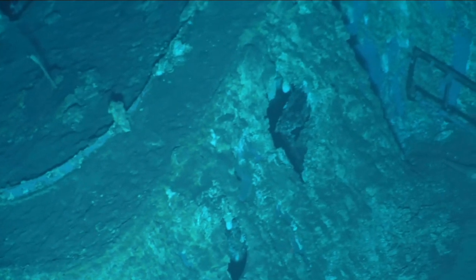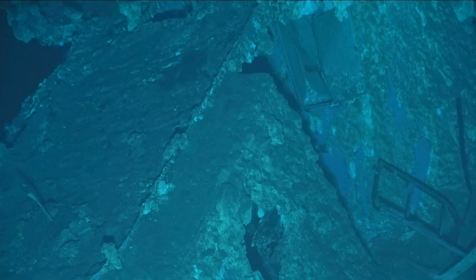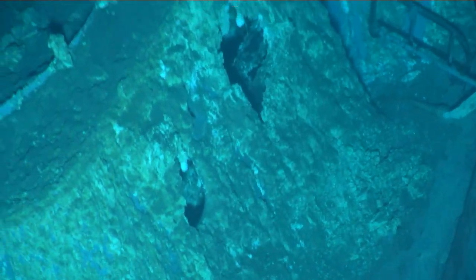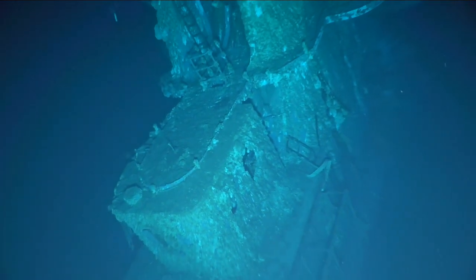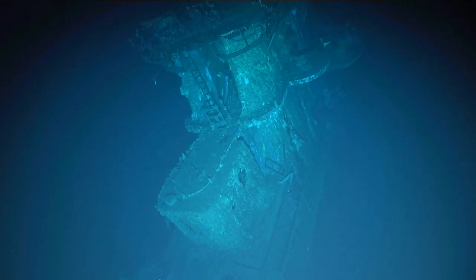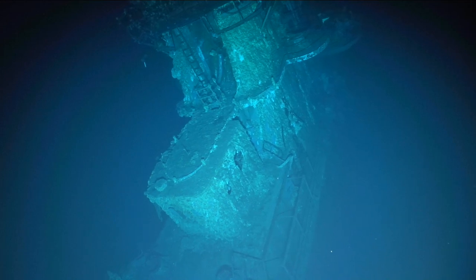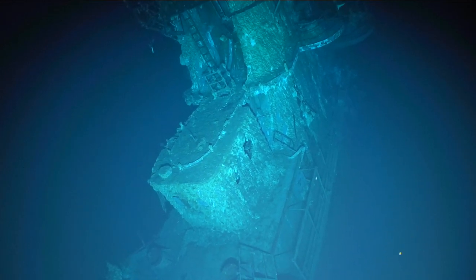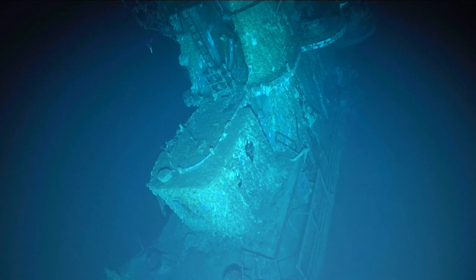So the question is, does that look like corrosion? That looks like massive corrosion just pouring off of that wall to me. Yeah. And that means something's really changed the surface of that steel compared to the surface of the painted steel. And you see that aft as well. Yeah. And if it really just baked this to red hot up there, maybe that was the difference. Right, it doesn't have that protective paint. And once an opening like that is exposed, it's just raw steel, then it's going to have all the corrosion make that rough edge around it. It's interesting that you don't see that back in this area. Yeah.